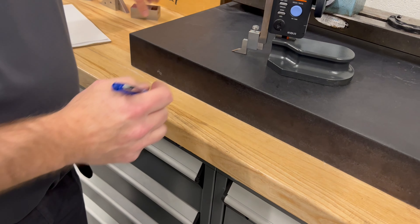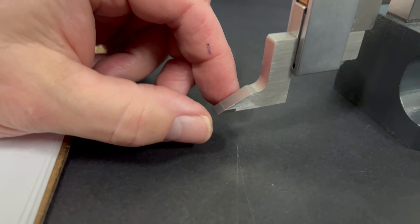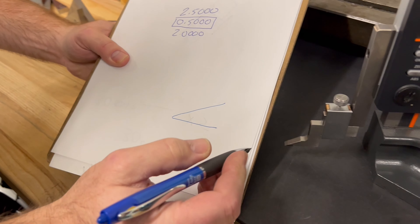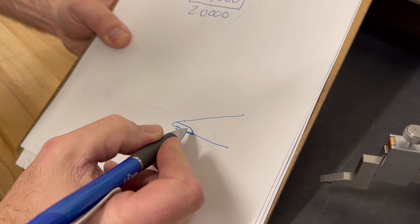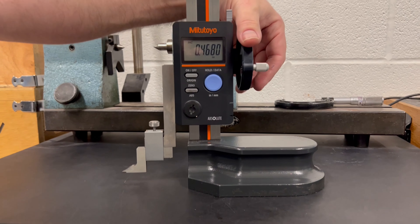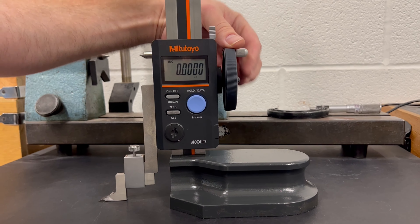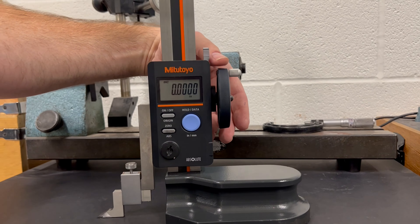Before we get going, we're going to talk about the actual tip. Sometimes the tips are carbide and they do break. The bottom of this piece is a knife blade, but sometimes from slamming it in improper use it chips. So this might not actually be at zero height — you need to inspect the actual tip to make sure you are on zero. I inspected this tip already and it is good. Now setting the height gauge zero: some people slam this down, which physically lifts it off the plate, then they hit zero and wonder why their layout numbers are not correct. So be very gentle when you set it down, then hit your zero.